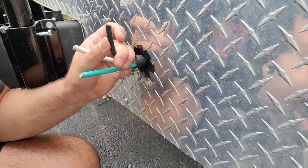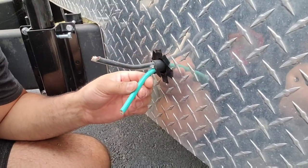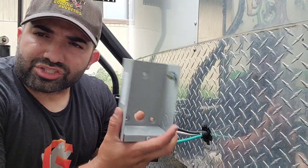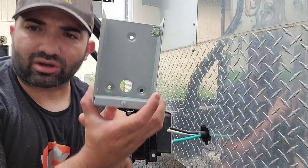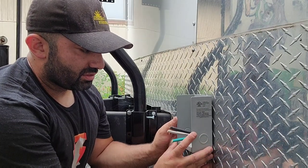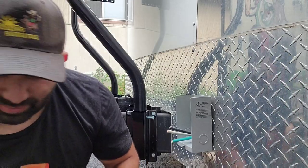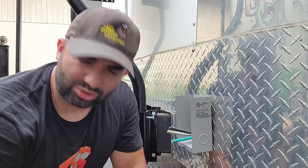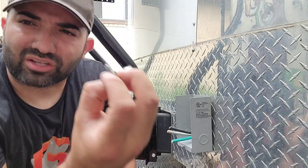Now I have all three cables: the black wire which is your power, the white wire which is your neutral, and the ground. Those three cables give you your 120 power. We take the back of the generator inlet box — Reliance part number PB50 — and slide it in. There's a half-inch knockout that you remove. Then we take our Milwaukee impact driver and use number 12 three-quarter self-tapping stainless steel screws — they have a bigger Phillips head and are hard to find right now, but I'll link them in the description.